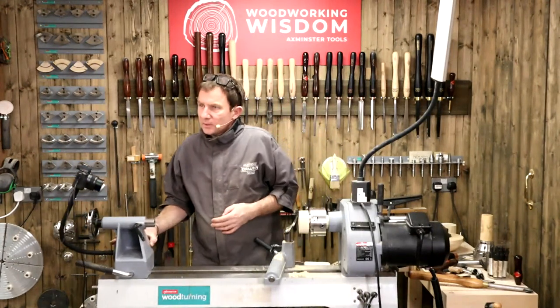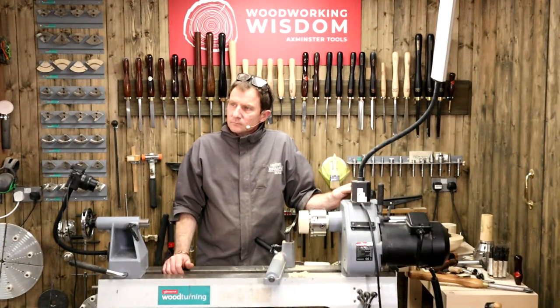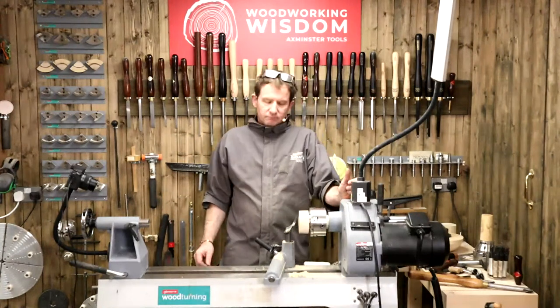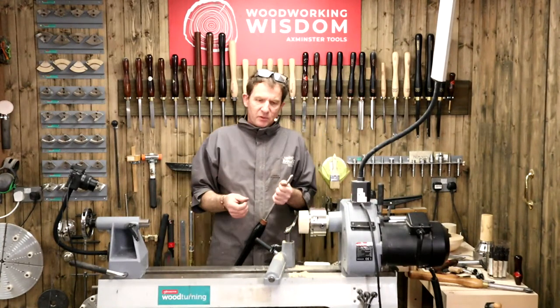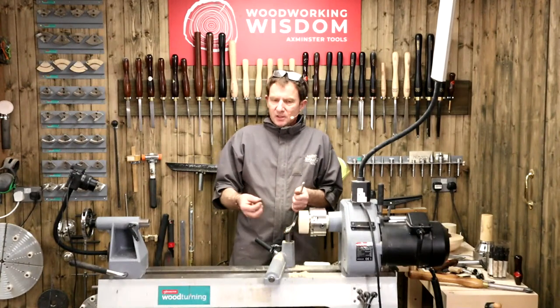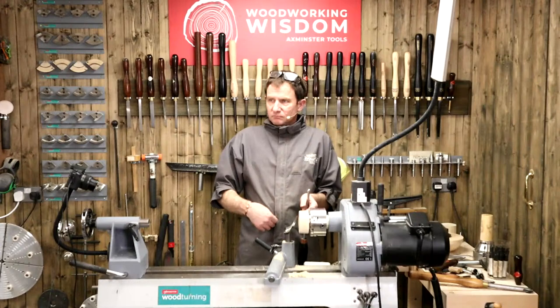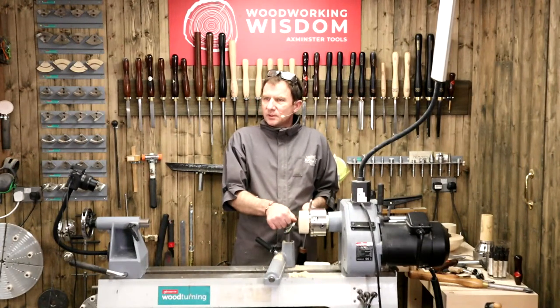Colwyn. Yeah, Maria is just asking, if you felt the first pass, the cut didn't go deep enough, could you re-go over it? Would it pick up the same cut or make a mess? You can. You've got to be able to pick it up. And that means the problem normally with that, if you think about what we've done, taken the lathe off, turned it off, it's probably, all right, take the tool back out, might move the tool rest. You've got to pick up that same angle.